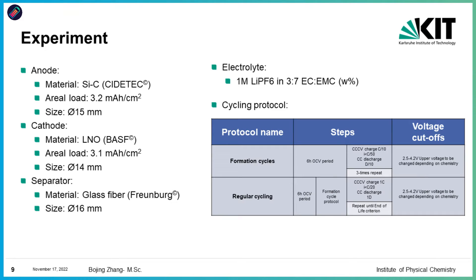We demonstrated this on a fairly new and hot chemistry: in the anode we have silicon in the graphite — really high-performance anode materials — and on the cathode we have a completely cobalt-free LNO material, with a pretty standard electrolyte. We also show in the paper the formation process, including the initial charge, which serves as a baseline for other researchers. They can compare the presence or absence of certain peaks in the dQ/dV plot to tell whether their cell is behaving in the exact same way as ours.